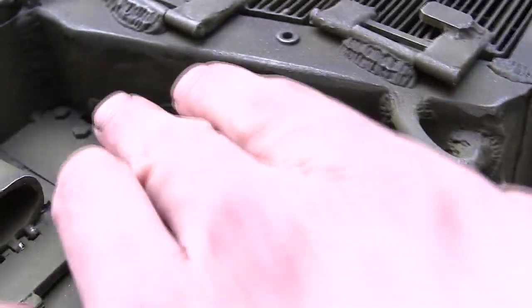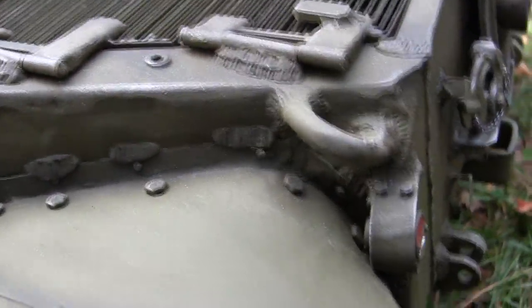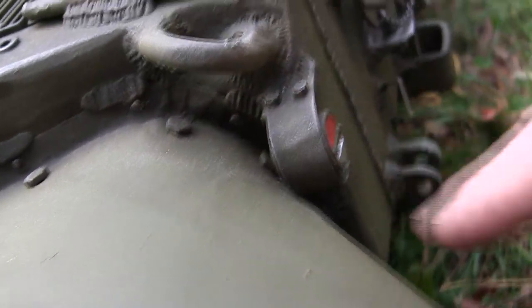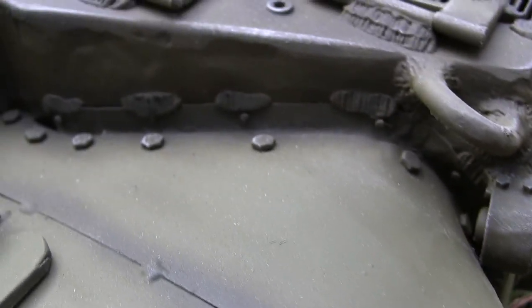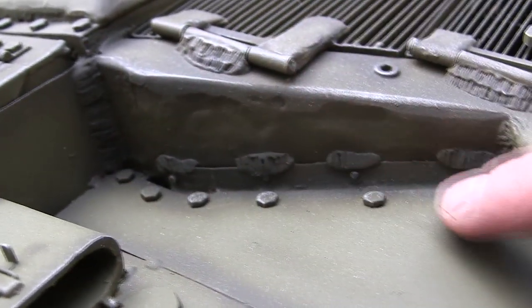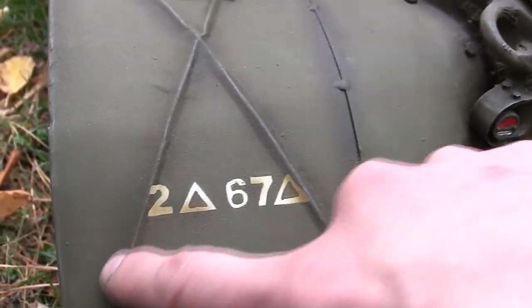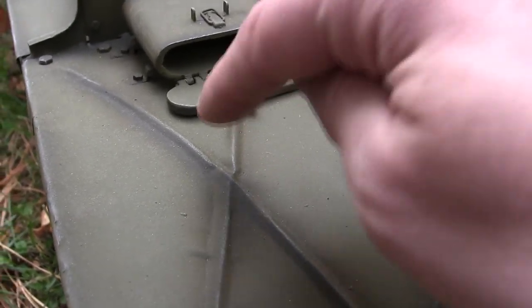To mount the fender to the sidewall, a steel angle mount was fabricated and had to be hand crimped for it to work with this elaborate curve that we see here. These fasteners are all real and are the actual fasteners that keep the tin work to the model as well as the fender. If we notice on the rear portion here, we have an X crimp. This is for rigidity purposes. The X crimp is actually crimped into the steel.